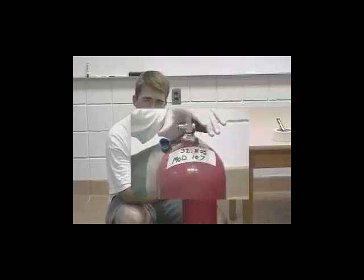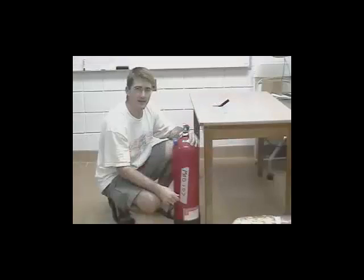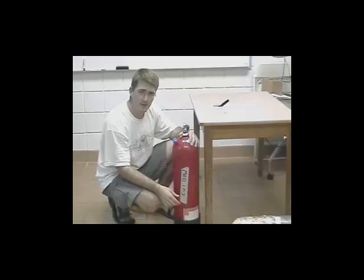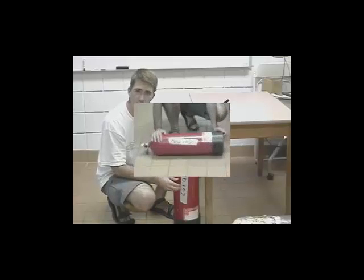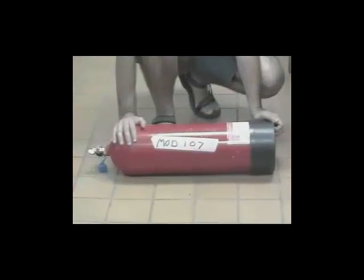Now we need to label a tank with our percent oxygen and our maximum operating depth that is rounded to safety. For any dive where your planned depth is close to your maximum operating depth, I would recommend also marking your MOD vertically along the side of the tank so that it's visible when the tank is on the BC. This will serve as a reminder for you, and it will also be visible to divers around.